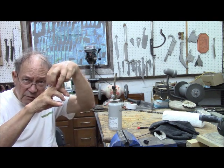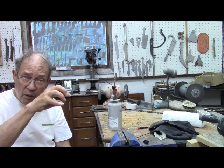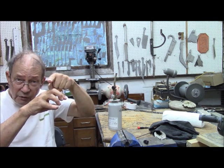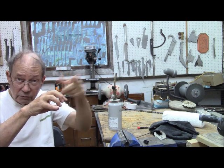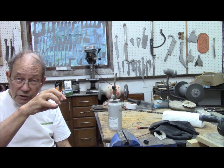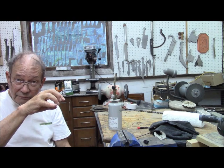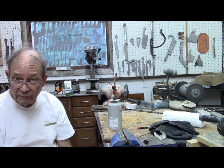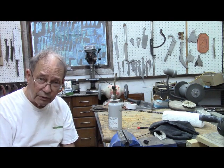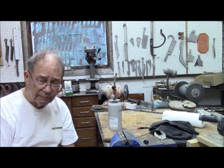I could not remove the scroll. There are two ways to get at it: it has a hole through the top — it's a round ball with a transverse hole — so typically you put a rod in there and just twist it and it screws up. Alternatively it's slotted for a screwdriver to go through the top. Neither of which would work. The usual remedy when you have a stuck screw like this is you put penetrating oil on. Tried that, still couldn't move it.